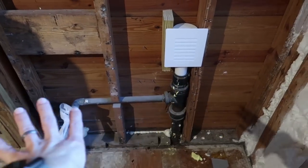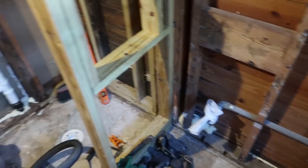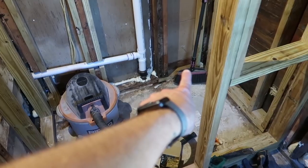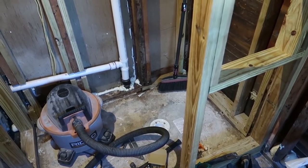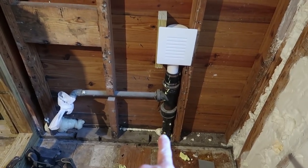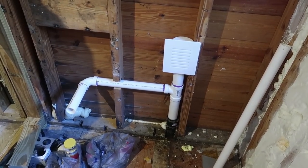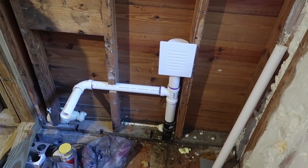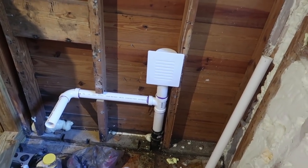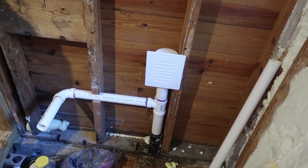Today I've got to do more plumbing because there's no plumbing here — no plumbing for the sink or the toilet — so I have to stub those out today. I just need to drill right through that spot and go underneath the house and connect the plumbing. I also determined I'm going to cut this down and replace all of this with PVC. That already looks cleaner and better, and it'll fit behind the drywall better too, because the cast iron had knuckles on it that would make it stick out from the drywall.